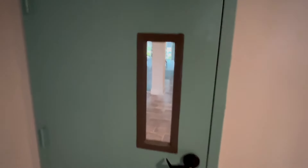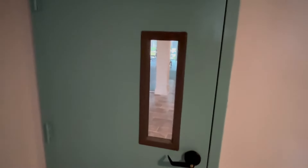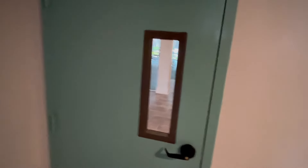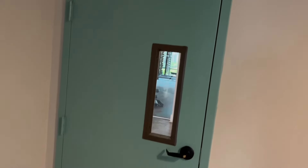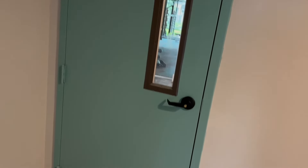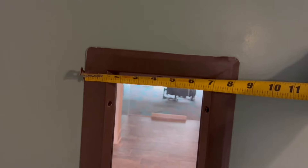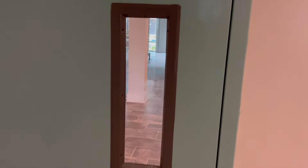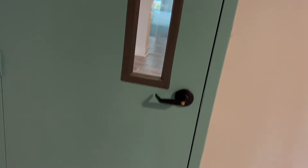Let's say they did want something with this window. First thing we do is take a picture of the door - that way we can share that picture with the door supplier. And then we want to measure the window. That's eight by 23 and a half. I've never replaced one like that, but that's probably a standard size.